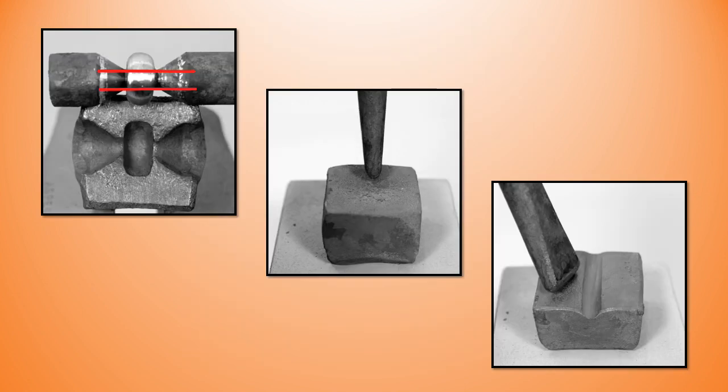A constant part of the blank, as I've shown with those two red lines, is a central round section seen at the neck of the collar. This is where I'm going to start making my bottom tool as it helps me position everything else. I'm using a 5/16 to 3/8 of an inch handheld fuller and I'm just going to start a groove across the face. As you continue to work on this tool that groove will get larger, so don't go too big to start off with.